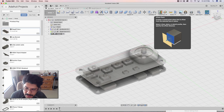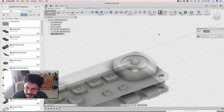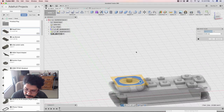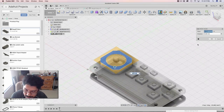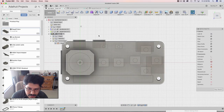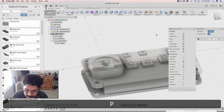This is an offset construction plane, and this is gonna allow you to make an offset plane. I'm gonna click on that and select this top piece of the joystick — this is the tallest component in the Joy Bonnet. I'll click on that, hit okay. Now I have this orange-looking thing. I'm going to select that and then create a sketch from it.